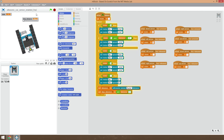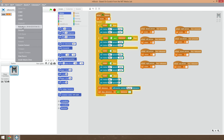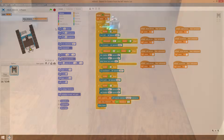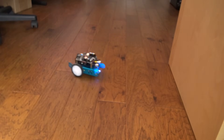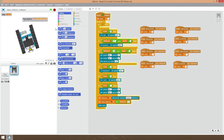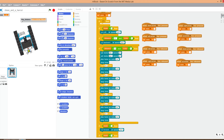In the ScratchBot software they had an example for an ultrasonic car, so I started from that. Once I moved over to the mBlock software, I swapped out some of the updated pieces — so instead of having to set the speed for both motors manually every time I wanted to change state, now I can just pick Run Forward or Turn Right and set the speed. I also added a couple of variables to measure the distance of the ultrasonic sensor from whatever it sees in front of it, and added code in the Go Forward section to make sure it didn't get too close to objects. Then just for fun, I started playing around with the Play Tone option, so that when you get too close to an object it plays a note that sounds like an error message.